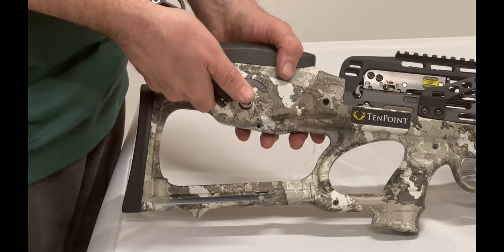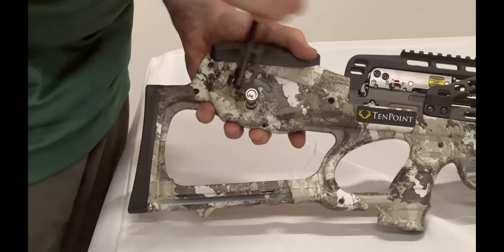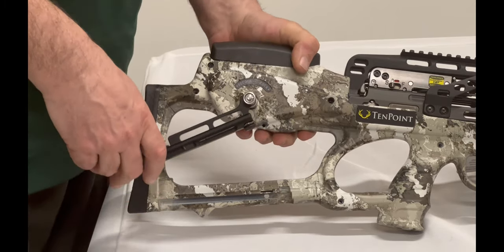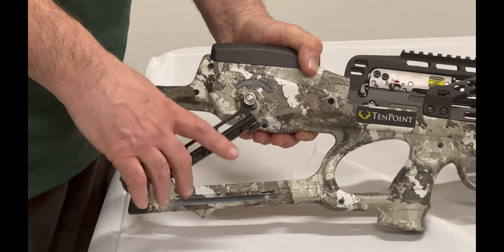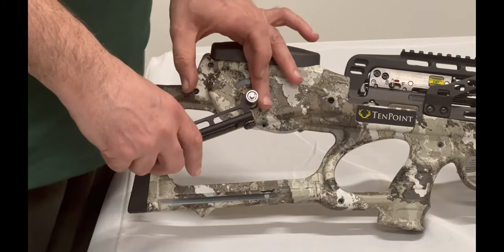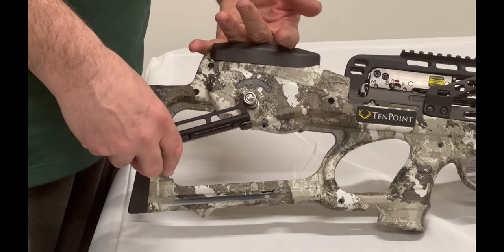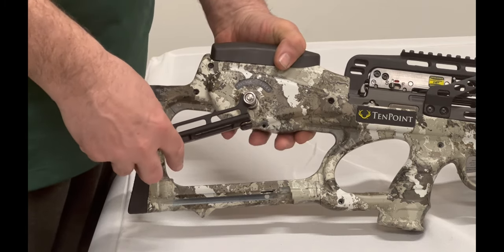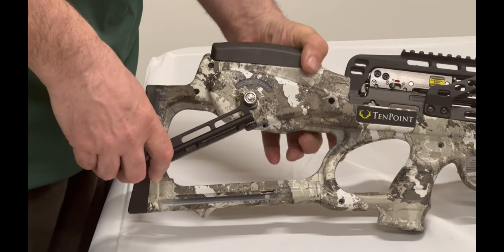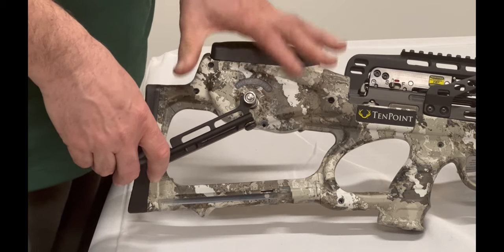Occasionally when back cranking the crank system after you've brought it back onto the latch, as you go to back crank and do your two turns, when you hold that button you may get a clicking noise and haven't necessarily gotten all the way around to either the full half or one turn. It's not a problem. What happens is that depending on the condition of the brake pad and how tight everything is, sometimes just back cranking two turns means that additional one turn or half turn isn't even necessary. The bumping noise is you bouncing off the button at the bottom on the gear and the teeth of the crank.